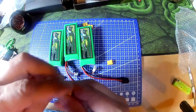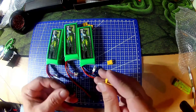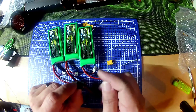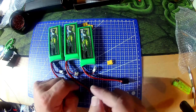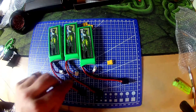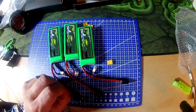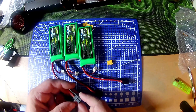Have a sacrificial XT60 to hold the others, to hold the pins in place so they don't fall through and don't lose alignment. Do one terminal at a time — one polarity — and you'll never short out or anything.